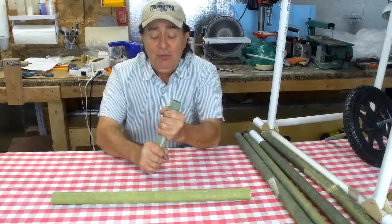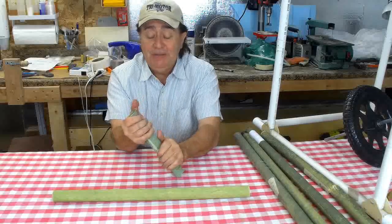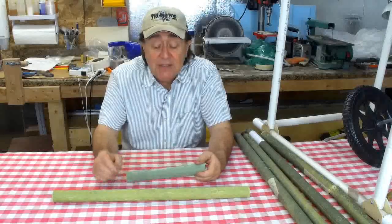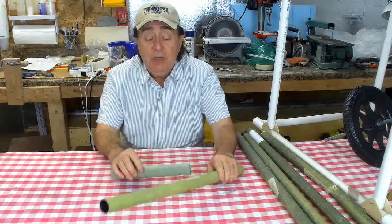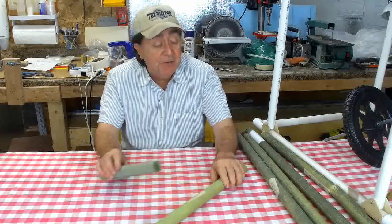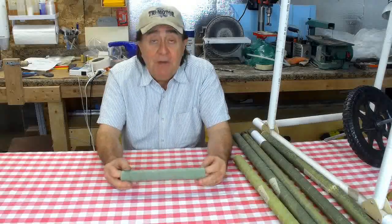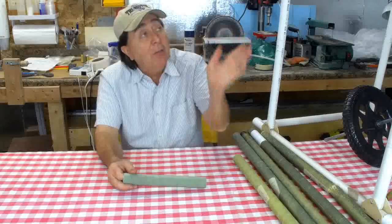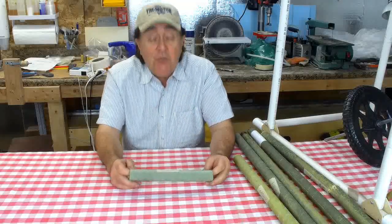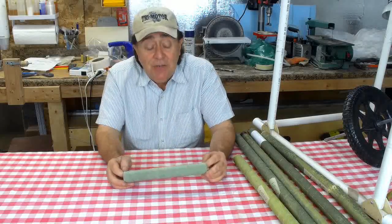But this thing is really strong. It's a little bit more flexible than this in compression. And I think one more layer of fiberglass on this would bring it up to the weight of this tube, but even stiffer. Same weight as this tube, but much stiffer than this one. And I think that this could probably be the very best answer overall. Build the entire pilot's cage for a pound or less, excluding the fittings, which would be amazing. And nominally, I'd go ahead and do that.